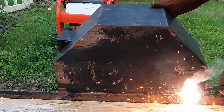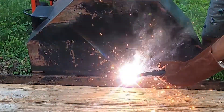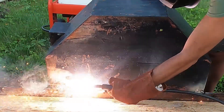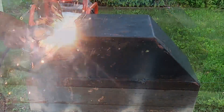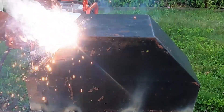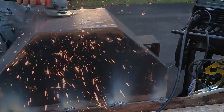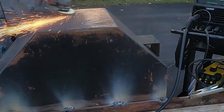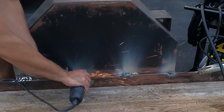In my process of testing this welder, I'm using flux core wire right now — I didn't buy a gas bottle, no gas shielding. I wanted to see at 208 volts how this would work with just standard flux core, and it works great. It's one of the best welders I've used. The next step was to grind down some of the welds to make them smooth using a flat disc sander wheel with a very coarse grit.